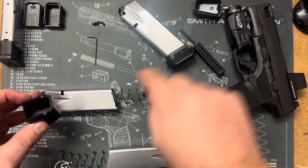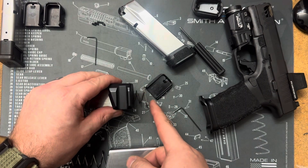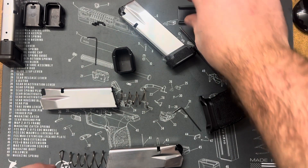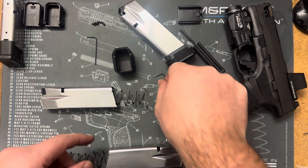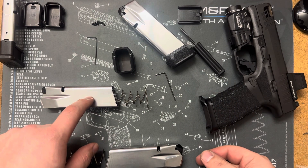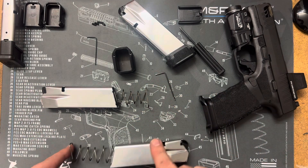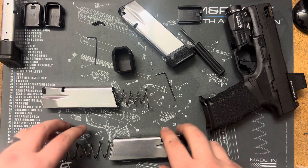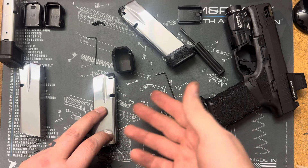Our plus five does work with the 15 round spring that is a little bit shorter. It has enough tension that it does lock the slide back. The first couple of mags through the gun it wasn't locking back, but this was a brand new gun with probably only 200 rounds through it before I tested these out. By the third mag through, it was locking back just fine with the plus five. The plus two would work great, but it also works with the plus five with zero issues. If you are having trouble locking back with the plus five, lube up your gun really good, let it work in a little bit, and see how it does.